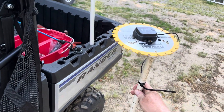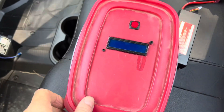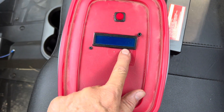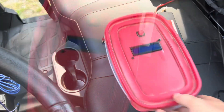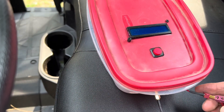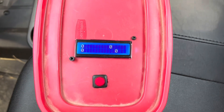The surveyor consists of a GPS antenna on a metal plate on a pole that I can hold out and put next to trees. Then I have a battery-operated little device with a little Arduino in it that reads the GPS position off of a GPS chip. When I push the button, it puts the position onto an SD card. So hopefully at the end of this I'll have an entire file full of the exact GPS locations. Let me connect the antenna cable and plug in the battery — we are good to go. In a few moments it will figure out its position.